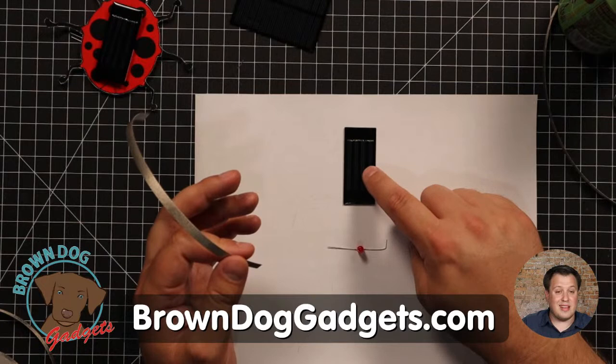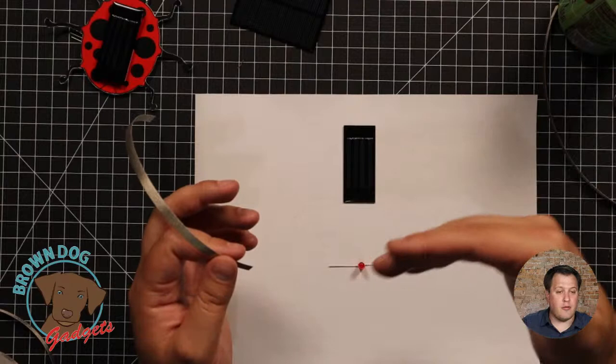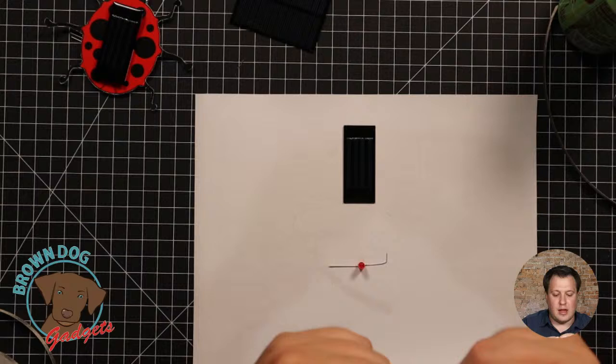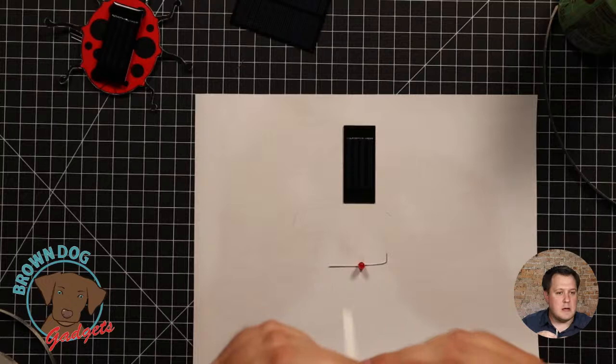Yeah. Which is exactly how an outdoor garden light works. It uses the solar panel and a transistor to turn a gate on and off. Either power flows to the battery from the solar panel, or the gate flips the other way and power flows from the battery to the LED. Yeah, it's really simple and easy. I love opening up garden lights because there's nothing to them. A cruddy AAA battery from China. Really cruddy, like a third the power, if even that. Usually 300 or 400 milliamps instead of the 1800 you get from a commercial one. So, yeah, it's a lot less.